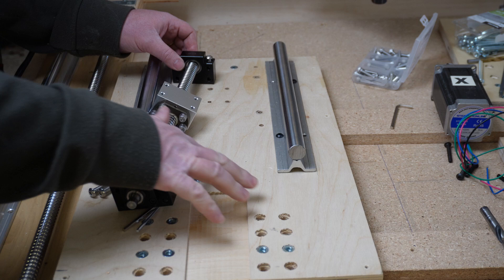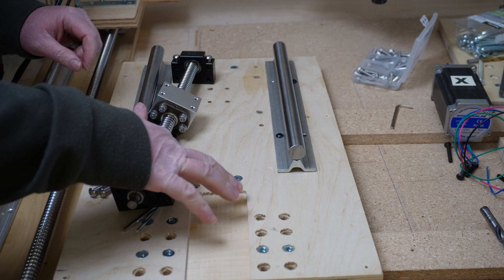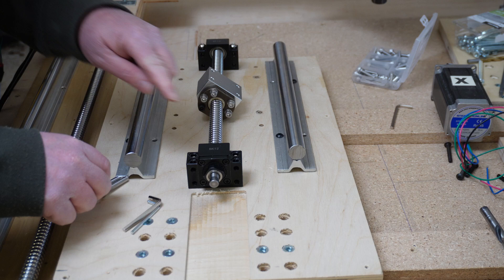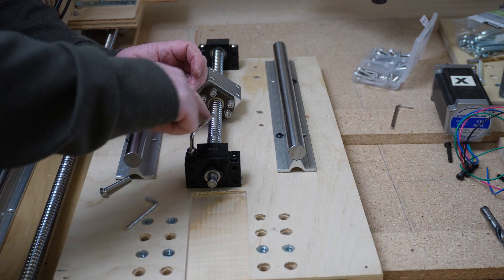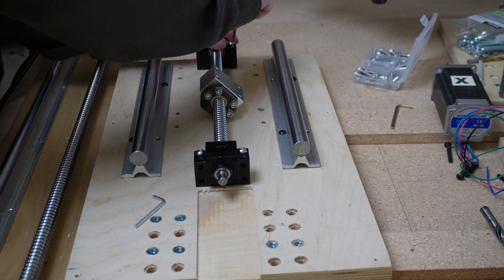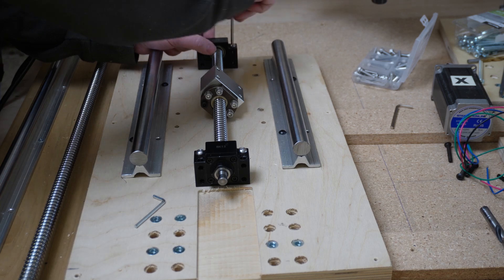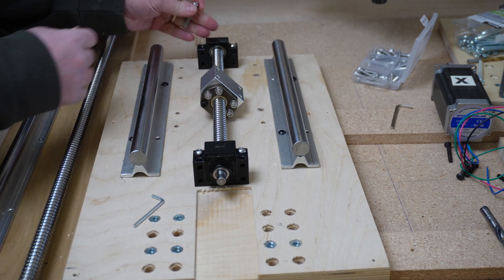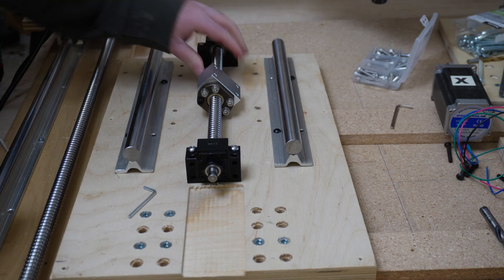Only put inserts in the top hole and the bottom hole — don't try to put inserts in both side holes or you'll probably weaken the joint. It's better to just have the two. Screw in the BK12 first — there's a reason for this. The other block can float, so it's easier for alignment to do the fixed one first. Then line up the other block, catch the bolt, and tighten it down. Get the second one and tighten it down — it should be solid.